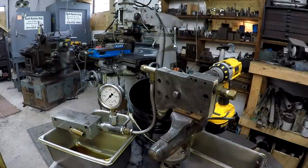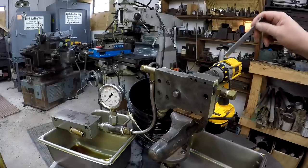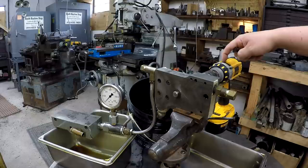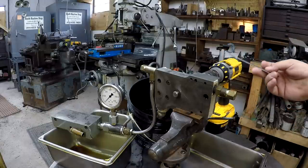One of the things that I do not know is my proper RPM that I'm running, because I'm using a drill motor. What I do know is that I've got it in gear selection number 2, so mid-range, and that's between 1 and 1250 RPM. Okay,